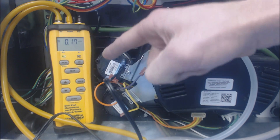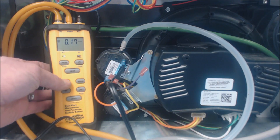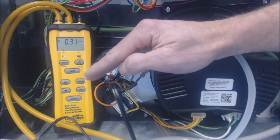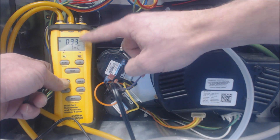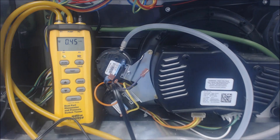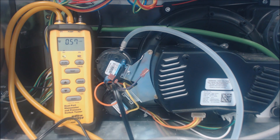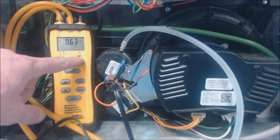Right now the light is not lit — it's not closed — and our pump is reading 0.16 inch water column. We are pumping negative pressure, as you can see it says 'negative' right there. Since we need to get up to at least 0.85 for this pressure switch to close, we're going to press the up arrow. It's going to say 'increase,' and if we hold the button it increases rapidly. The pump will also try to catch up, so after you let go, it's often still increasing.